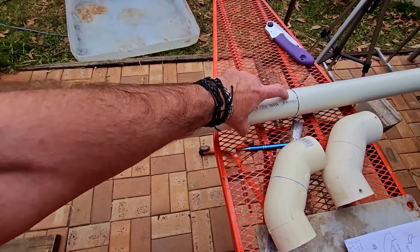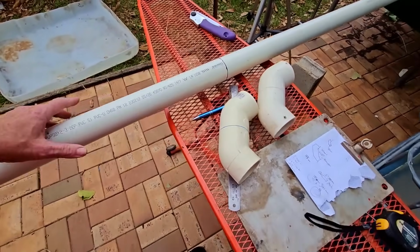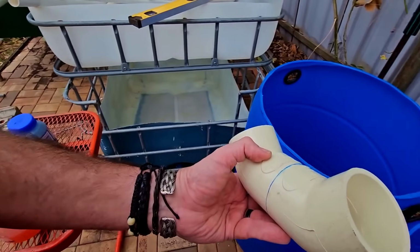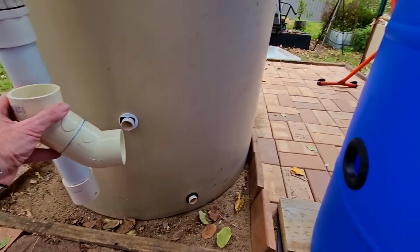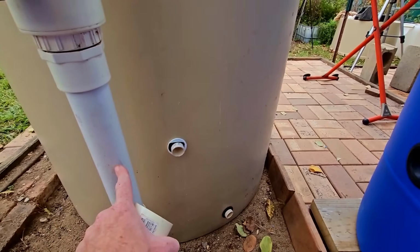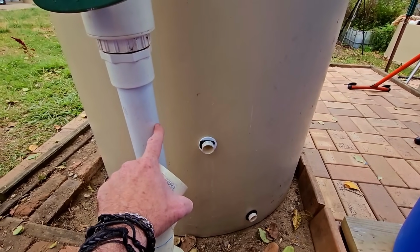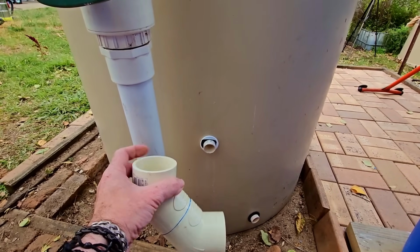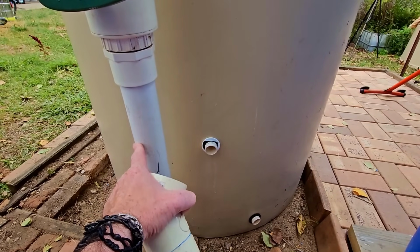So I'm just going to cut it there. I'm actually going to do it up under the house in the big saw, just because it's a lot faster and gives me a nice even cut. And on the other end, we're going to have this fitting here that will end up going here and running through that wall there, and there'll be another one on the other side as the upflow. Now this pipework here, once that's installed and I know roughly where I need to cut here, I will be coming across here and cutting off a section, and then I will be gluing this onto the base, and that top will have one of the rubber cuffs that join it together. That way I don't need this height to be absolutely perfect.